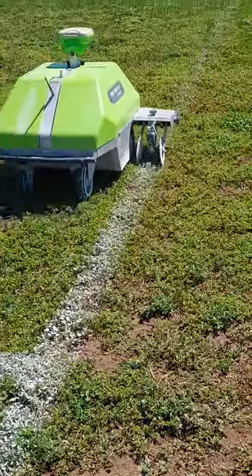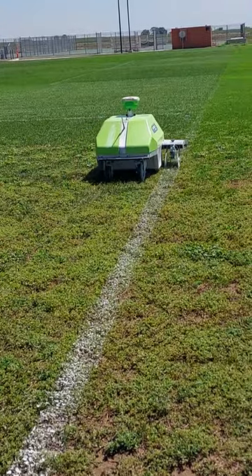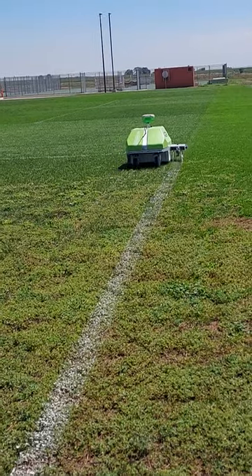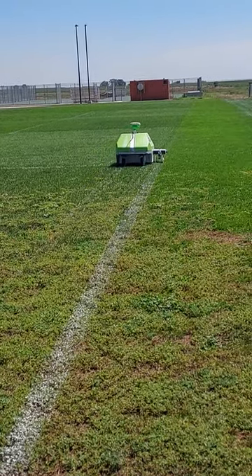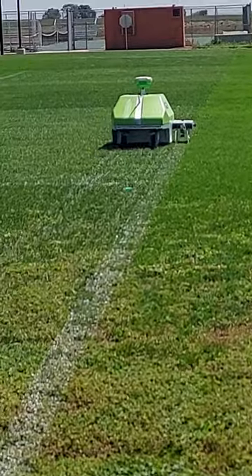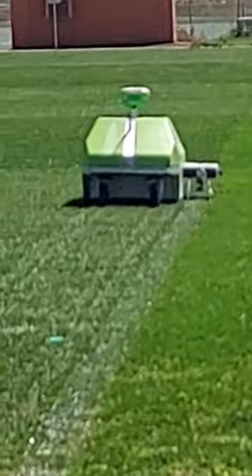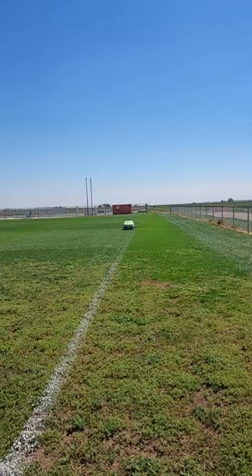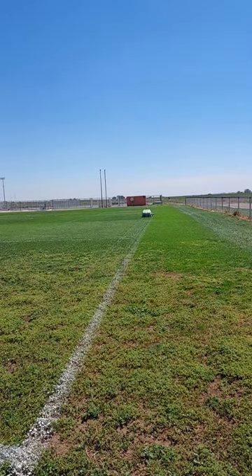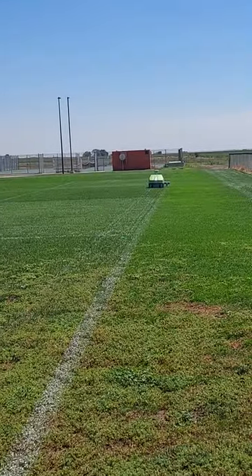Because of the nozzle I have in it, I don't have to change paint. But if you put a heavier nozzle in it, you've got to change paint once or twice. It's done by gallons per hour — GPH. This is a 110, which shoots out 110 degrees, and then 01, which is one one-hundredths of a gallon an hour.